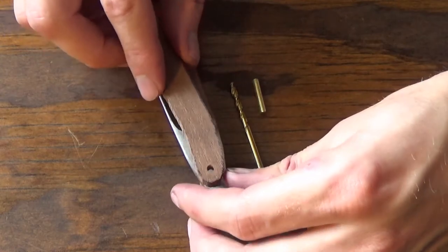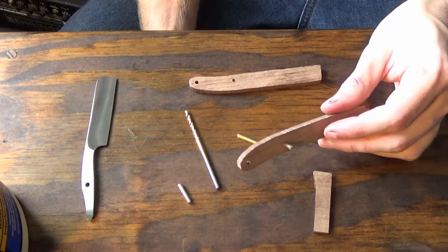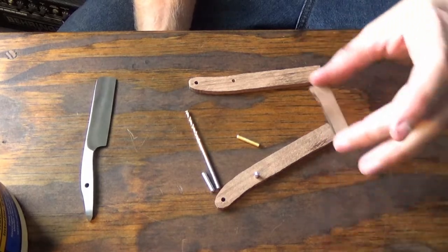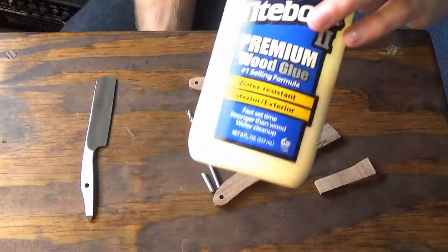and finish the blade. If the handle material were some sort of metal or even a micarta or other similar synthetic like G10, I would probably epoxy the back spacer in. However, on this, it's wood. I can use wood glue.